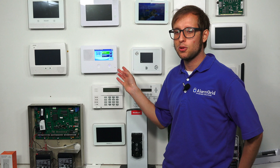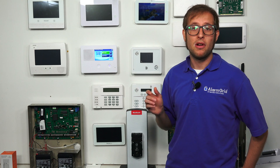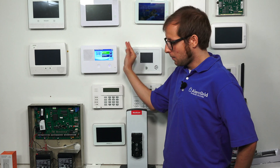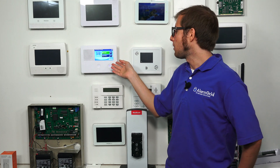The maximum limit is 232. Once you add a Z-Wave device, you can control it locally at the panel, and you'll also be able to control it remotely from alarm.com, assuming the system is monitored and you have access to alarm.com. That allows you to control Z-Wave devices through your phone using the alarm.com mobile app or a web browser. Note that alarm.com has a smaller Z-Wave device limit of 122 devices. When you go to add the 123rd device to the panel, it won't get pushed over to alarm.com — you'd have to delete a device, let alarm.com refresh, add the new device, let it refresh again, and then it will appear on alarm.com.